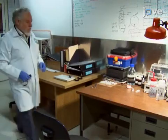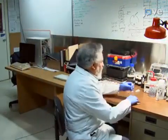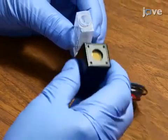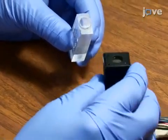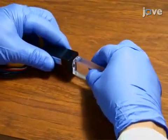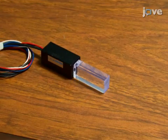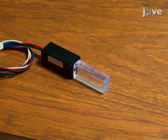Begin work on the PET setup by preparing the detection system. Make each detector using a photomultiplier tube and a polished plastic scintillator piece. Design the scintillator piece to match the size and shape of the photomultiplier tube light entrance to allow good coupling.